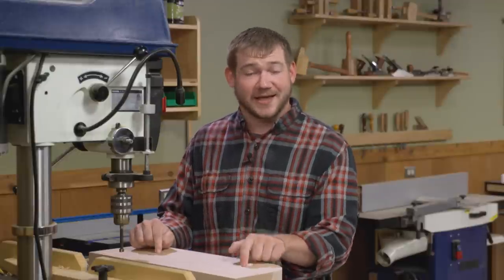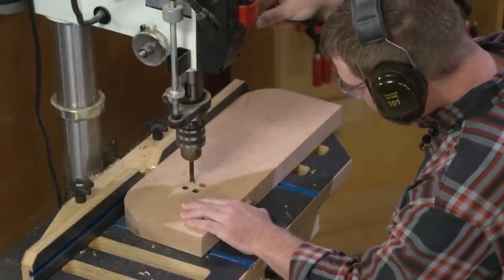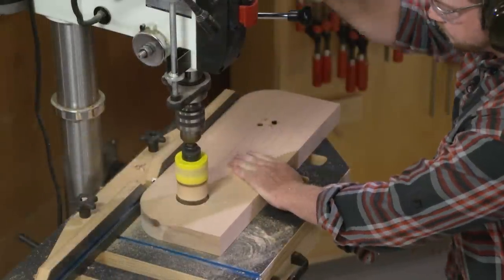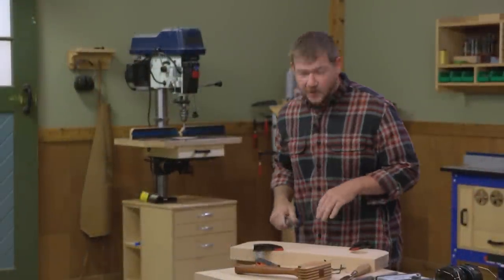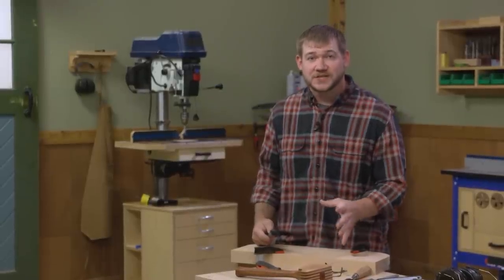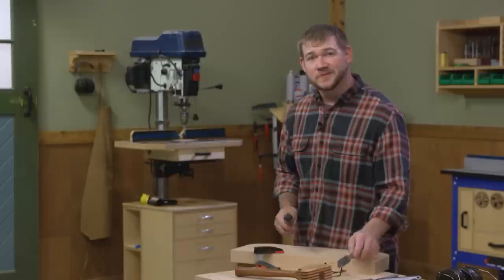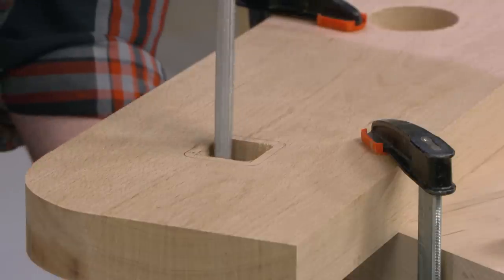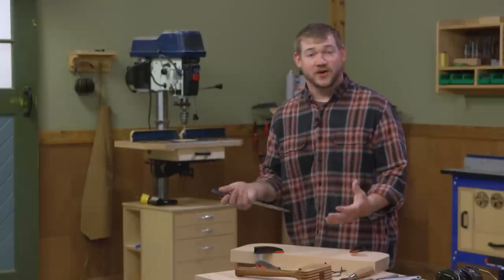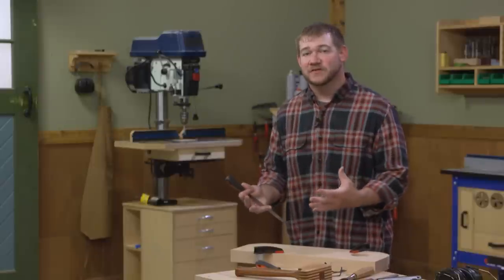I've equipped a half-inch bit in the drill press — that's going to match the radius we'll put on the tenon of the support arm. We drill that out, then put the hole saw back in to cut the larger hole, and head back over to the bench to remove the rest of the waste. When done at the drill press, there are just a couple of things left: use a jigsaw to remove the waste, then switch to a chisel and a couple of files to create parallel walls inside the mortise.